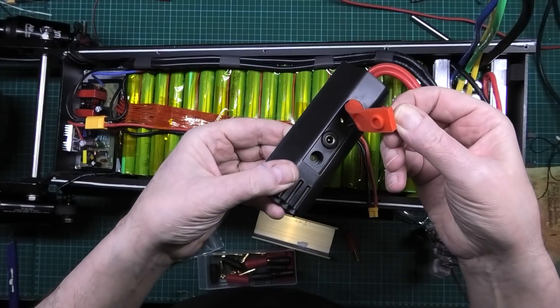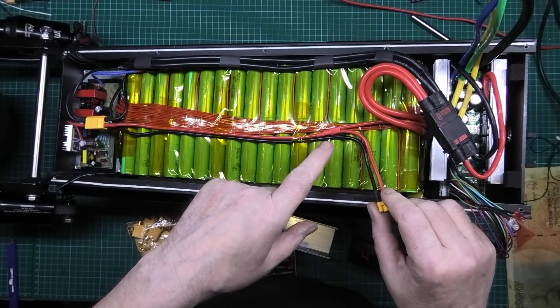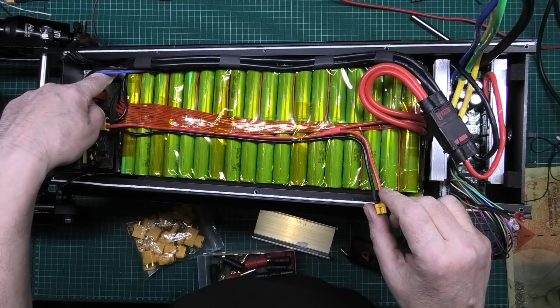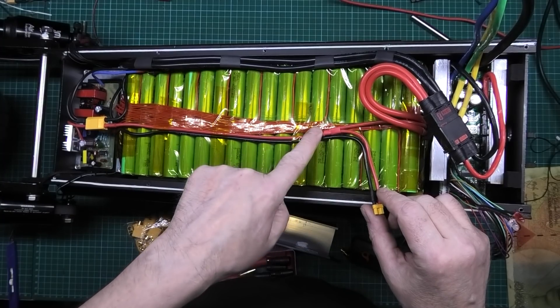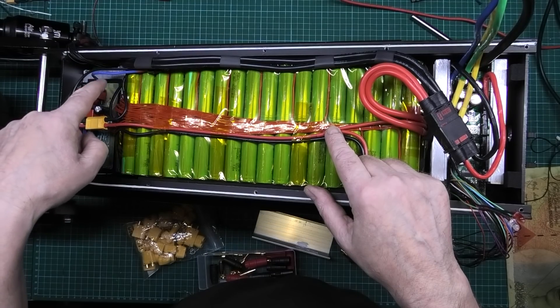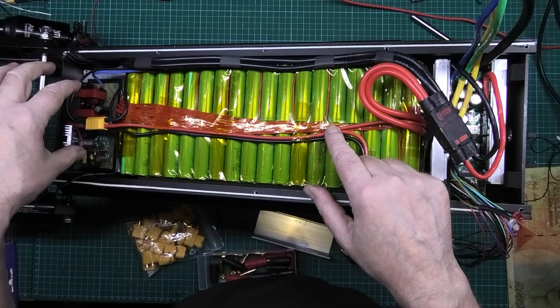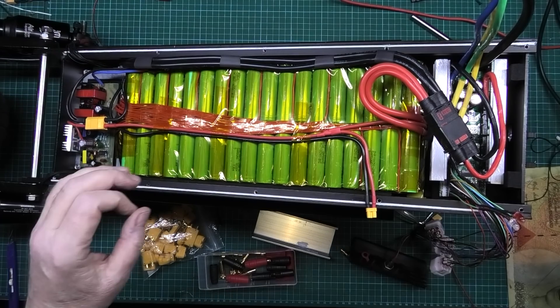This is for the charge port, which is the other half of that connector. For that I've connected the negative to the C-negative on the BMS and the positive goes to the battery positive, which is linked here. The other half of this wire goes down to the DC to DC, and the negative goes to the C-negative — that way when I power it up, this is powered up, otherwise it would be on all the time.